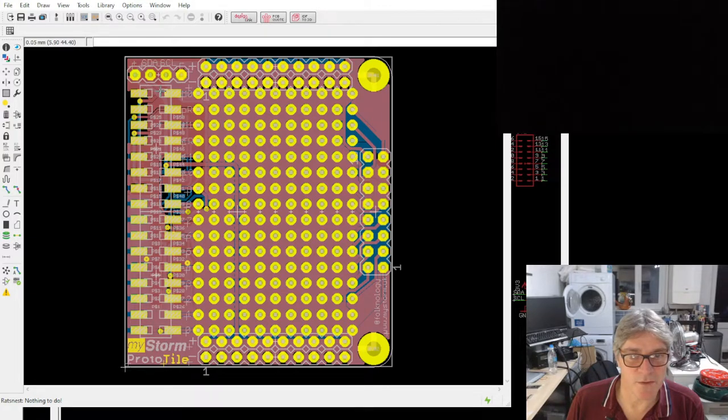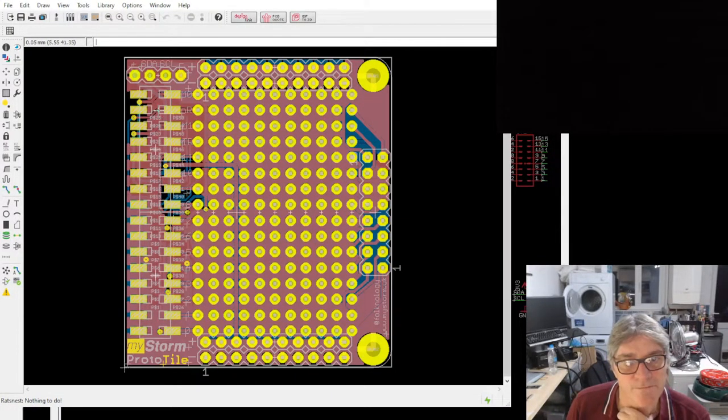And then you've got an optional surface mount 2.54mm pitch or 0.1 inch pitch header you can solder on. And that enables you to get to the signals on a header, for example, if you want to do a test-in-the-middle type thing. And then this can be used in the same way that the other PMODs are used. It's really like a patch board. You can just put some simple components in and then maybe a connector on this end to go to something. It's useful for just trying out different things. Very useful. I'm not going to dwell on that too much. So that's the proto board.